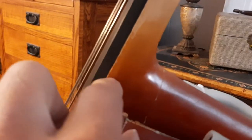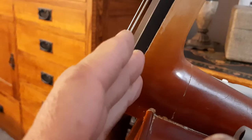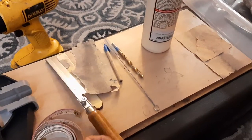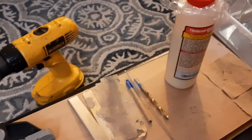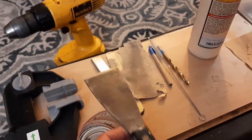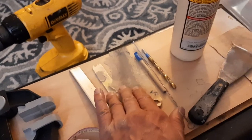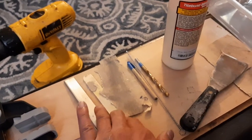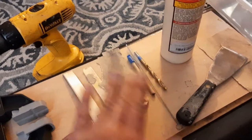Without the fingerboard, it was fairly easy — it took very little time: drill a hole, put in glue, stick in the peg, and then you have this peg sticking out. After that, I took this little saw and sawed off the top. It didn't take everything, so I used a scraper to scrape off a bit more. Finally, there was still a bit sticking up, so I used a tongue depressor and some sandpaper to get it down so you couldn't feel any bumps at all.